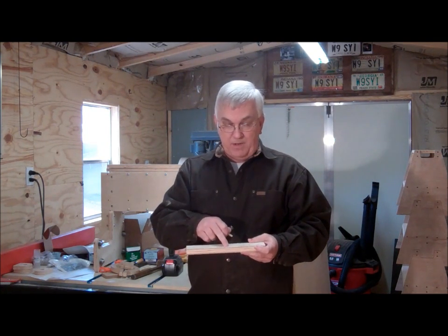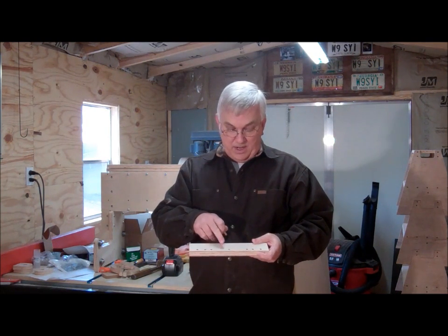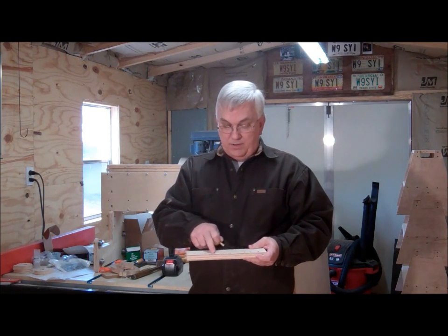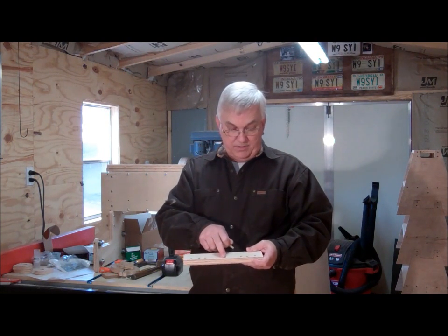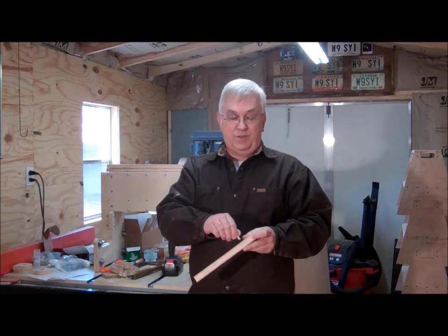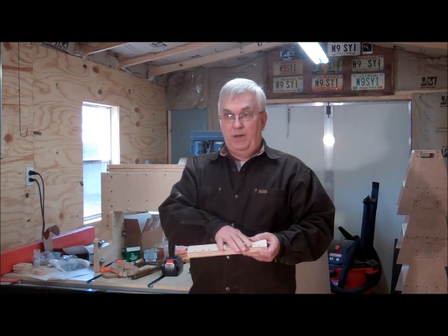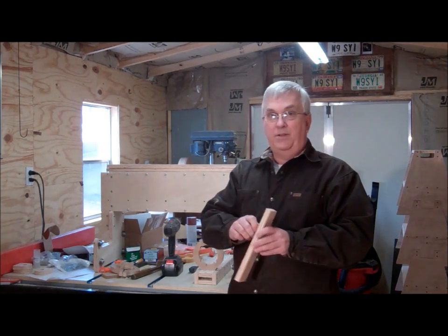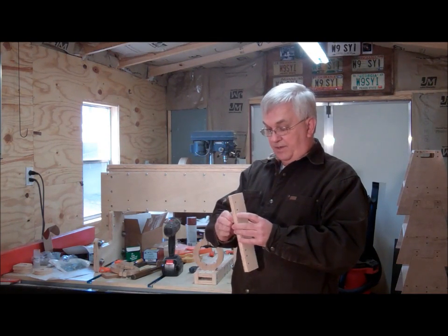So what I did is I made this little template where I'm going to set this up on my drill press. I'll put my drill bit here, and I've got holes where the ones on either side are two and a quarter center to center, then one that's three inches center to center, and the final one is four inches. I'll drill my first hole, then use a little dowel to locate the next hole so I can get them exact — because those were all cut with the CNC so they're very accurate.